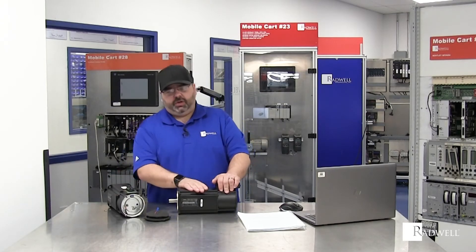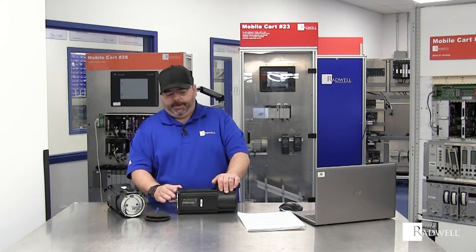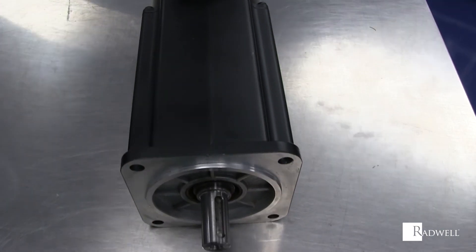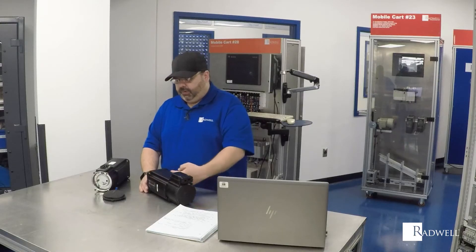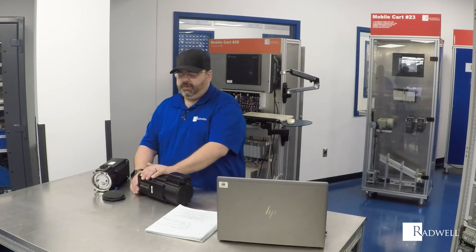When we talked about earlier, this front housing being one piece — that is good for rigidity, but it's bad for repair. In order to repair it, we can't just replace or repair this front housing. We have to go in and re-bore and sleeve this housing all the way from the back. But we can do that at Radwell — it's not a problem.